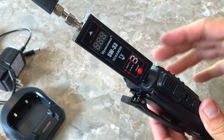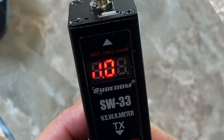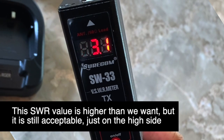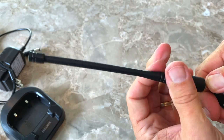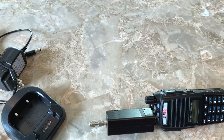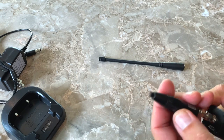I'm on a channel that nobody's transmitting on. Let's send some power out and see what the SWR says on the stock antenna. The reading comes in at 2.0 to 2.1 — not great. On a higher frequency it reads 3.1 to 3.0. I've tested half a dozen of these rubber ducky antennas with UV-5R and similar radios, and none of them work well in the GMRS range. They seem to be tuned for slightly lower frequencies.